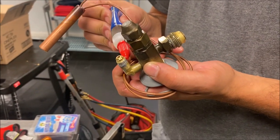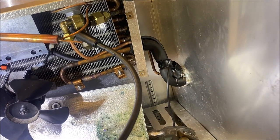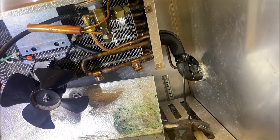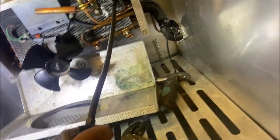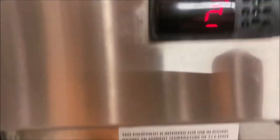We have her on and we're pressure testing at 112.8 PSI. Let's see if she held — let's go test our areas of concern. So far so good, no beeps. Looks like we have fixed the leak, but let's take our time in this area since the meter was going insane earlier. Looks like we're all good — one last check just to be thorough, and we're good. I'm happy with that. So we pulled a vacuum, recharged it, down to 2 Celsius, sight glass is full, and we finally cycled off — condensing unit's off. We're good to go.